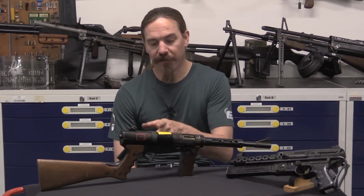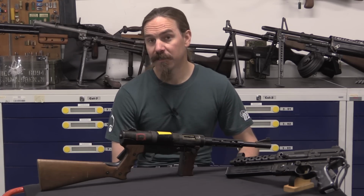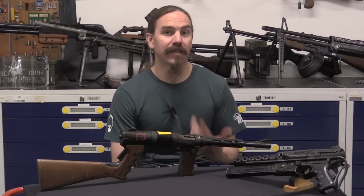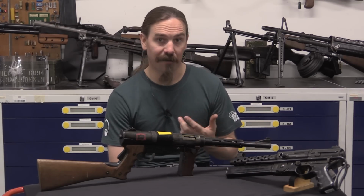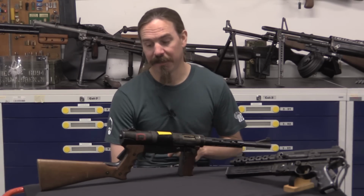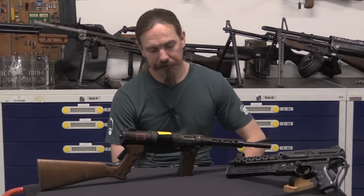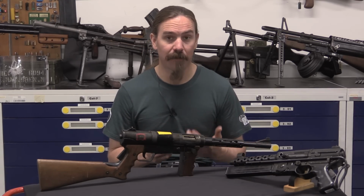Part of that would probably be the functioning of the dust cover, which does not automatically open when the gun is fired, and thus, if you close the dust cover, you can then depress the grip safety, fire the gun, and you will immediately have a malfunction as the cartridge tries to eject through the closed dust cover and jams. That's just not a good design. Shouldn't have been done that way, but it was, and that almost certainly contributed to the guns not being accepted after their initial testing. So, of course, this program would never ultimately adopt a design from Chatellerault.